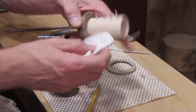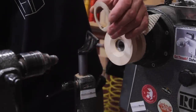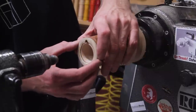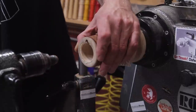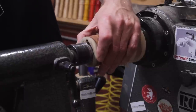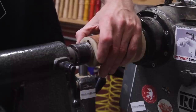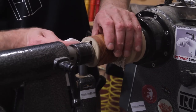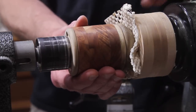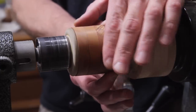I'm cutting them off a little bit proud and I'll trim them down after the glue dries. While this glue is setting up I need to glue on the last ring over the tumblers. To do that I use the lathe and the tailstock to open up the outer ring — put a little bit of glue on that last ring, try not to get any on the inside rings, bring the tailstock up and let the live center open up that tube with a little bit of pressure. I turn the lathe on to make sure all the rings are spinning freely and you kind of have to babysit this — I come back every couple of minutes to make sure all the tumblers are still moving.